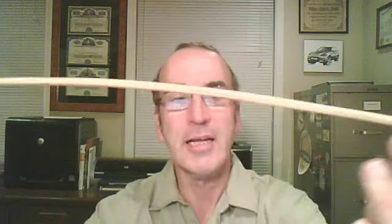This wire looks like it's in pretty good shape end to end. Right there, you can see this is a number 14 gauge wire, which is good for 15 amps in your residential house. Knob and tube wiring in the 1930s was put in according to code back then, and for the electrical demands that we knew of and were anticipating for 1930. However, as you know, that has changed.